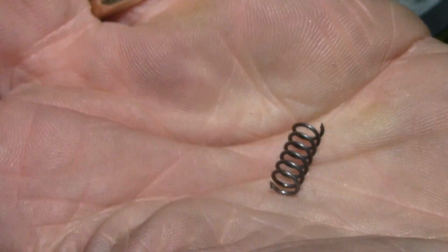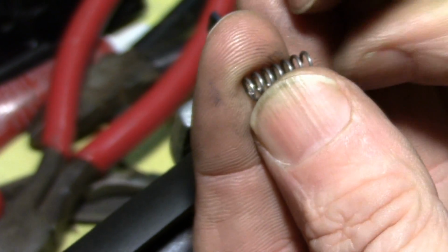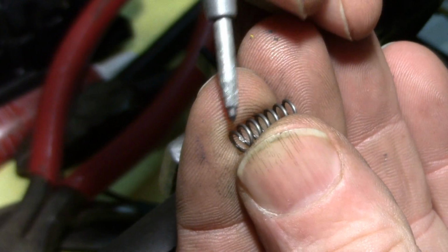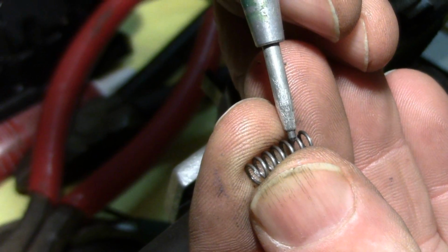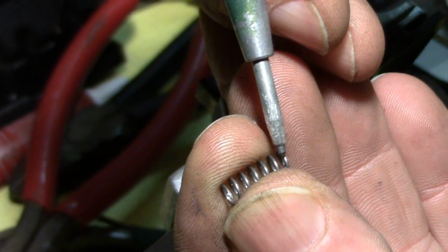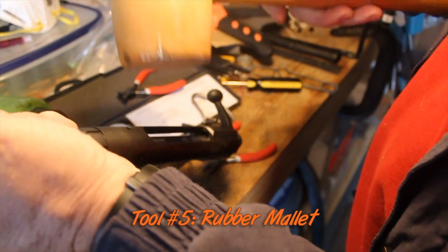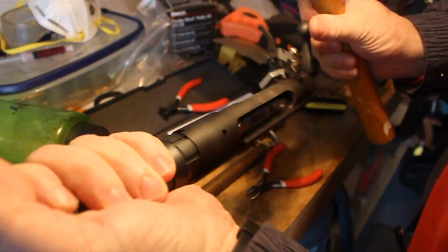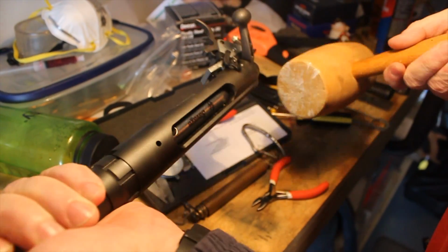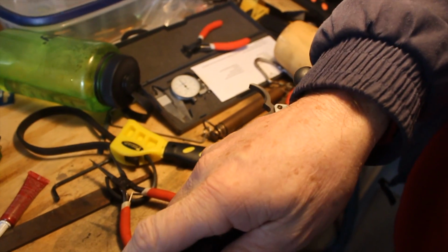Be careful here. The spring must always maintain contact with the tang, and there must be enough tension to hold the trigger steady under the sear. If you clip too many coils, you may end up with a trigger that fires unpredictably or won't hold the sear in place. Once you get down to about 4 pounds, test the trigger by cocking the rifle, leaving the safety off, and whacking the action with a plastic or rubber mallet. A safe trigger will withstand all but the most severe hits.